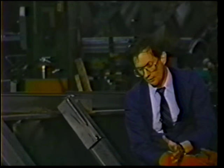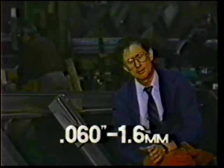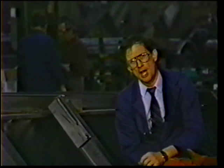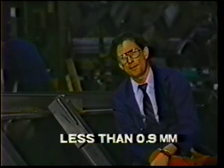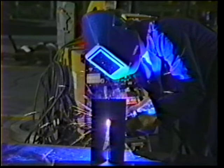When you select a welding gas for short circuit welding, there are certain factors that need to be considered. If you're welding on very thin metals, less than, say, 60 thou, then it's wise to use an argon mix which doesn't have a lot of reactive gas in it. What does that mean? Well, the typical mix in the marketplace is 75 argon, 25 CO2. But if you're going to weld on 25, 30 thou materials or weld along the edge of a sheet metal, then why not use argon with 2% oxygen?